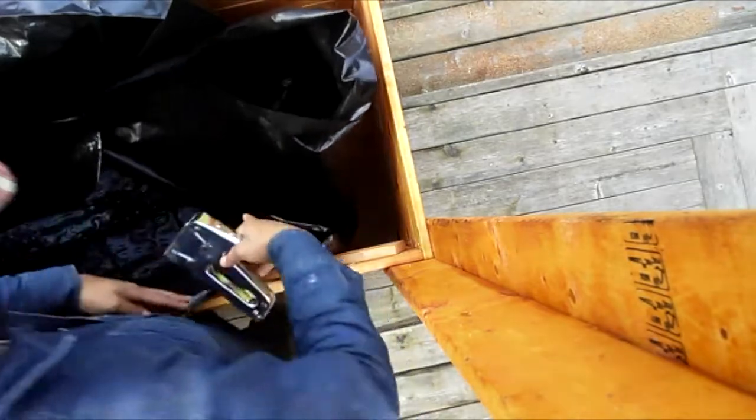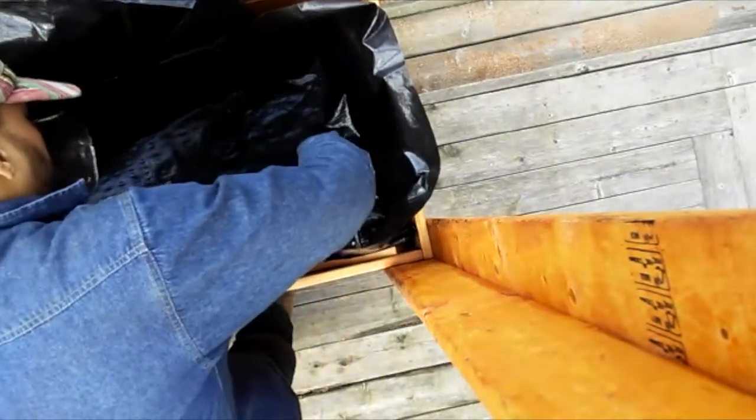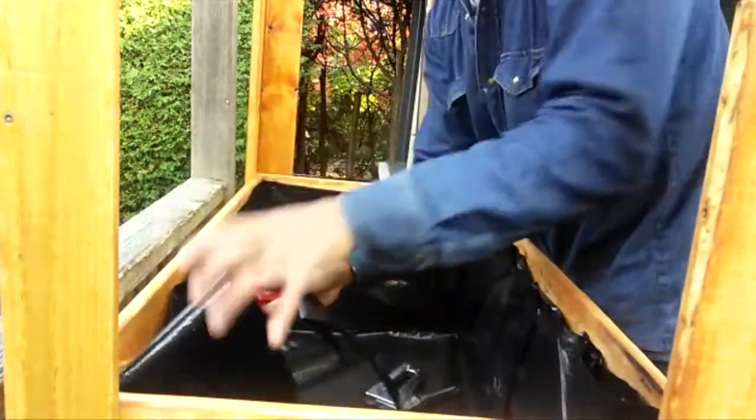The bottom of this box has a drainage detail — two pieces of wood on each side angled downward toward the center of the box, with about an inch and a half of space in the middle. Since this detail would not be seen, I used scrap cutoffs of 2x4s and pressure-treated plywood to build it, though you could also use the same 1x4 pieces as the rest of the assembly. Following this, I installed the bottom shelf, which consists of two 1x4 pieces fastened to the short side of the bottom, with several slats on top at three-inch spacing. Finally, I lined the inside of the box with plastic sheeting — I used a pond liner but any plastic sheeting works. I folded it against the corners, stapled it in place, punctured several holes at the drainage opening, trimmed the excess with a knife, then repeated the process with landscape fabric. The box was complete.